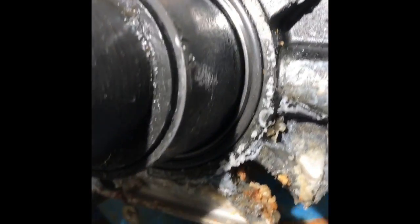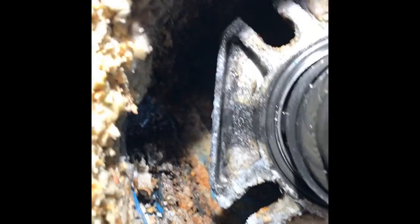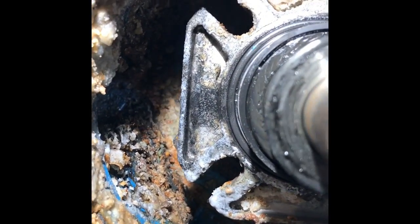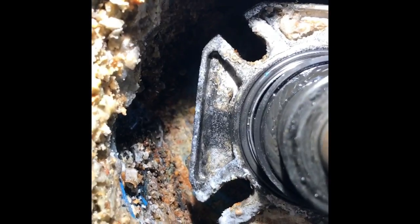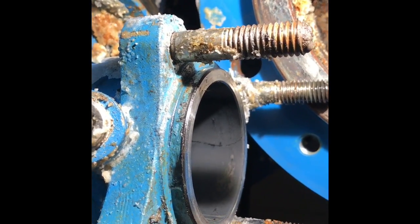See over there? That O-ring — if you look at the bottom here, clearly see all the black leaking straight out the bottom right there. So clearly, the O-ring is not seating properly on the outside here with the packing gland.